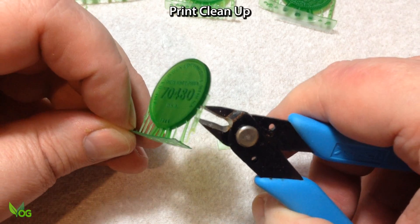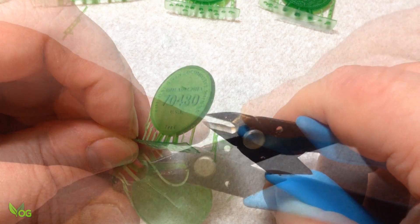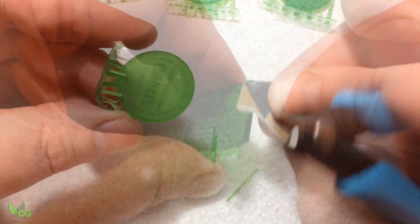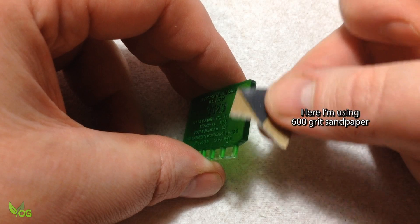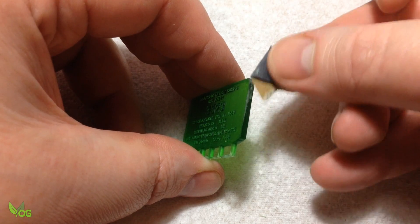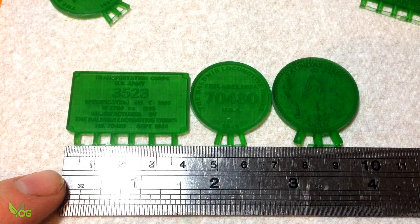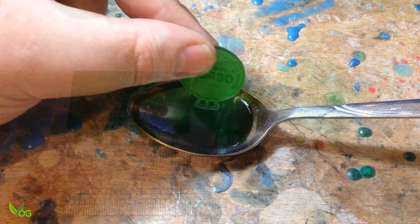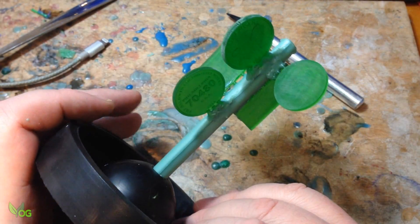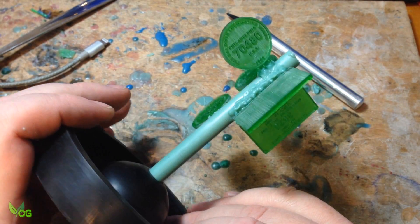The material is slightly more plastic-like than the regular resin I've been using, but it cuts easily and could certainly be a little fragile, so care is needed. I cleaned up the edges with very fine sandpaper and this was effortless — very little pressure is needed to ensure a nice flush finish. I decided to keep some of the supports to act as sprues. To thicken them a little, I dipped these into molten wax, which in turn helped me attach the prints easily to a wax sprue. From here it's just the standard investment casting you've seen me do before.